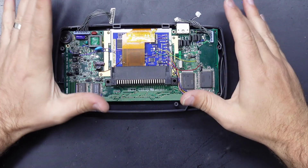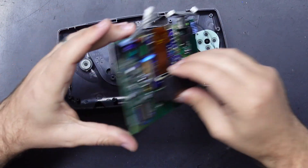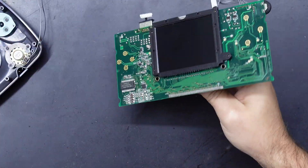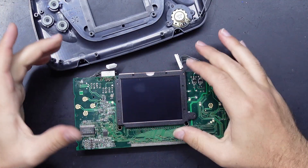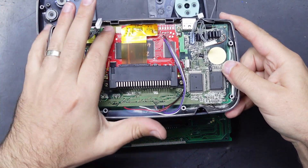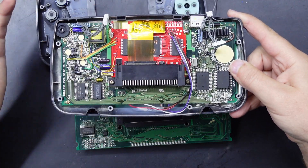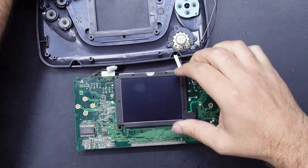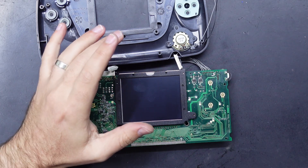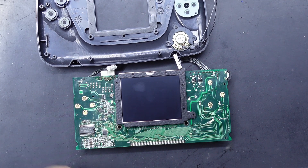Luckily I had another twin ASIC board. This is one of the ones that doesn't have a spot for the ferrite bead, so you need to solder the clock signal in between those two resistors next to the crystal, but this one actually works. One other little issue as I'm trying to put it back together is to do with this bracket. Now it is a 3D printed bracket, and I do prefer it over the McWill screen which you actually have to solder onto the main board and try and line it up. But unfortunately this bracket is just a little bit out of shape.